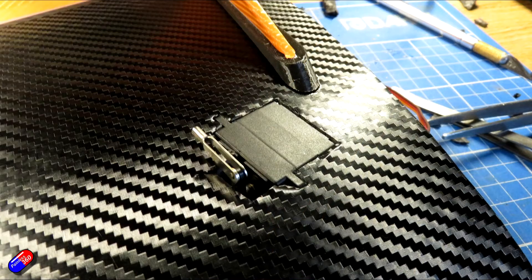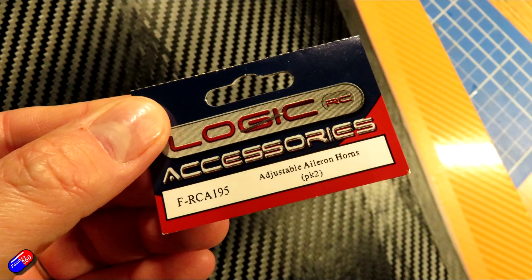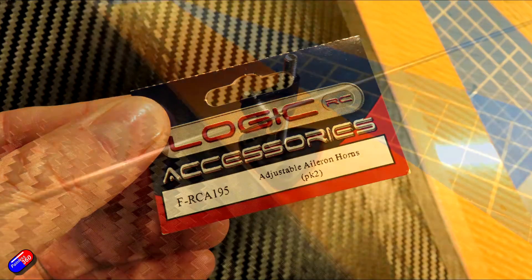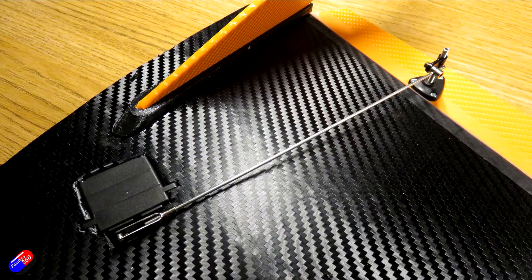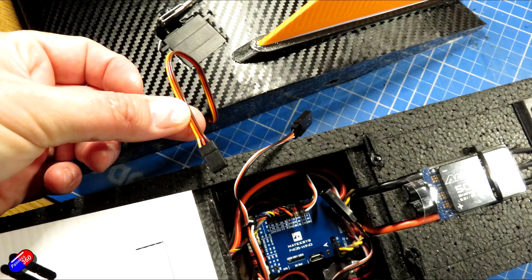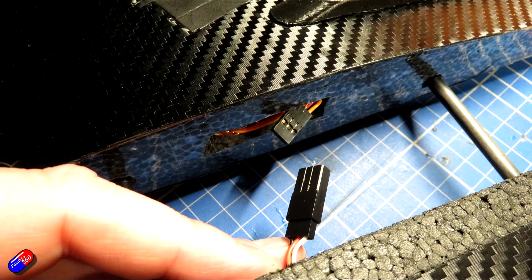All of the hardware to connect the elevons to your servo comes in the kit, and it uses a minutely adjustable setup at the back where it's very easy to get the travel that you want. I have also heard from E-Wings that they're thinking of bringing out strengthening kits — carbon fibre rods that you can heat shrink onto them; I might get myself one of those, as these are pretty long rods and they may flex when flying hard. Once that was done, I cut corresponding holes in the side of the electronics bay in the body and fed through the extension cables that connect to the servo cables going out to the servos in the wing. I also cut a recess in the root of each wing so that the cable and connector can fit flush.